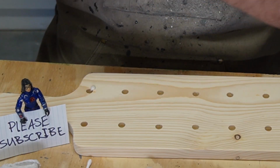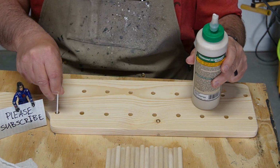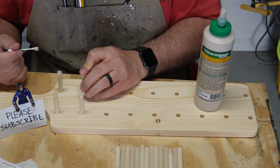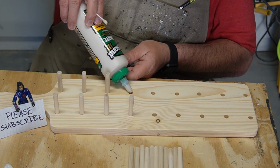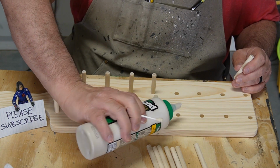Dope! I glued these with some Titebond 3, and I use Titebond 3, so before everybody says in the comments, you didn't need Titebond 3, you could have saved 35 cents. I'm using Titebond 3 because you're going to be wiping this thing down and stuff, so it's going to encounter water, more than likely. Unless you're a dirty slob, who am I to judge?